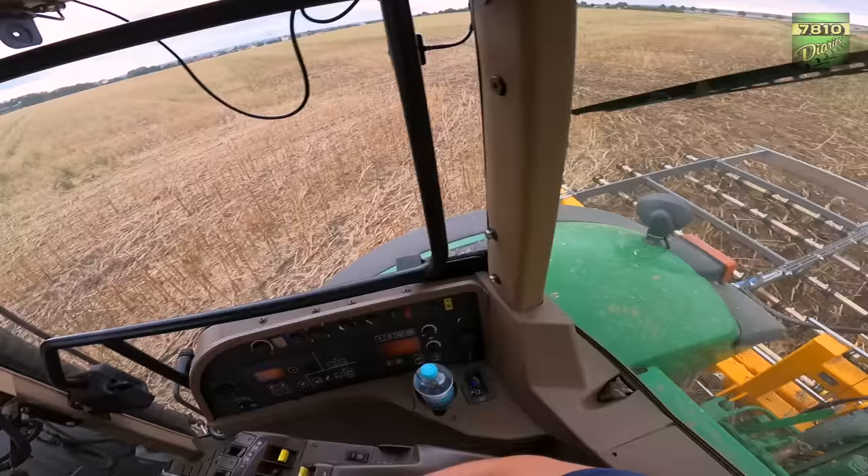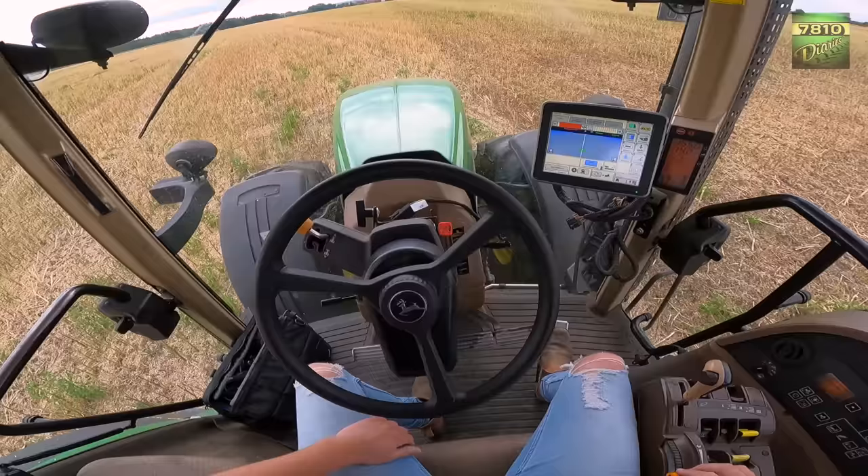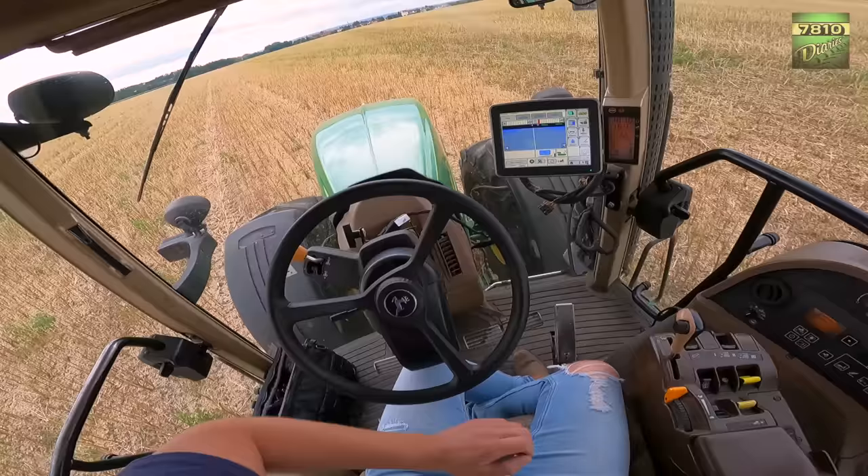The boss already told me to not treat the headland too aggressively. So no tramlines in beds, but always alternating up and down and back into the track. Press the AutoTrac button once and it settles in. I didn't place it quite perfectly there — otherwise it would have been a bit more harmonious. Then throttle back on.